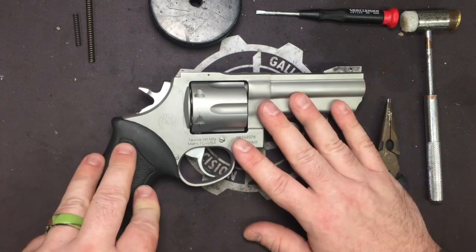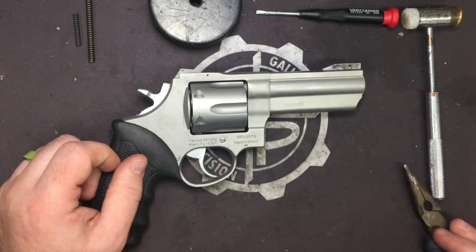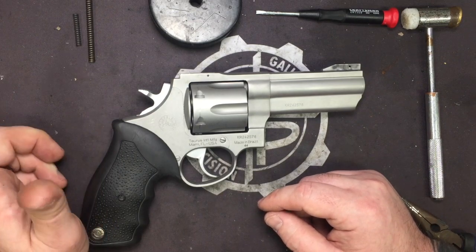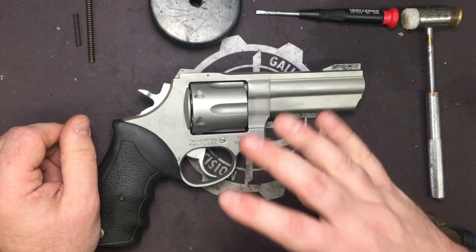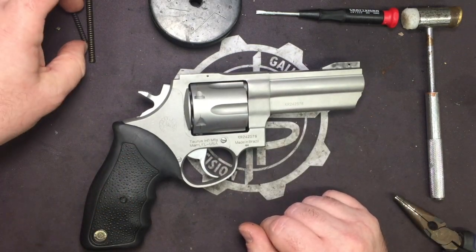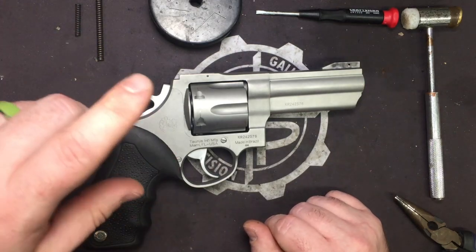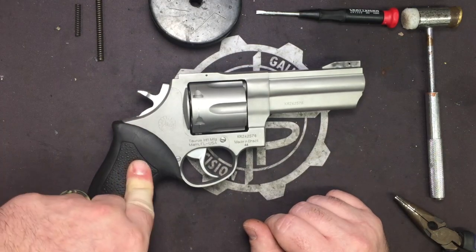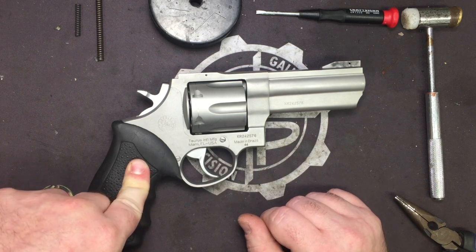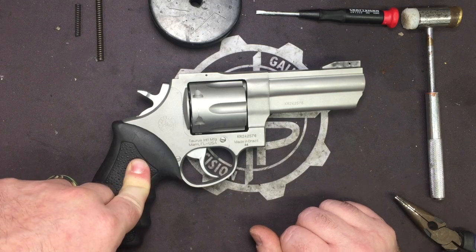Now in this particular revolver, our starting double action pull was 10 pounds and our single action pull was 6, which is actually pretty good for a revolver, but we wanted to go a little lighter for what we have planned for this one. So we did a 20% reduction of the spring weight, and when we got these back, the single action pull in the M44 went from 6 to about 3.5, and the double action went from 10 to 6.5.